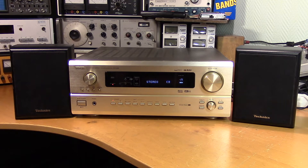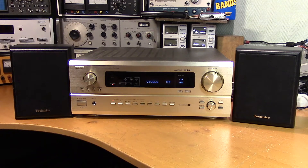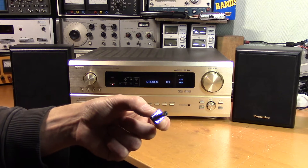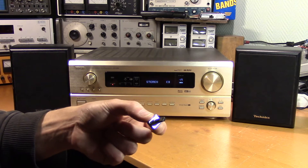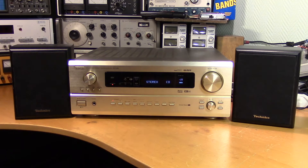So I'm going to show you another way to utilize the power amplifier part of this amplifier. All you need is a dual potentiometer — I'm using 20 kilo ohms, but you can use 10 to 100, it doesn't matter that much. Preferably one with the same threading as this one, and some shielded cable. That's it.